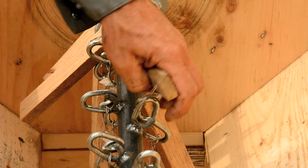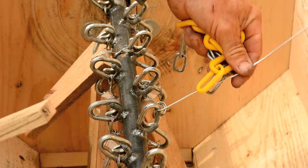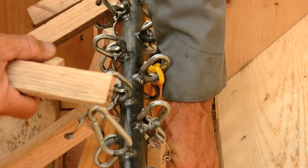This is the basic setup of the thresher. It just has flails on these little open links. We have experimented with a couple different kinds of flails. The bike spoke works very well for beans because it doesn't break the bean seeds. We have also experimented, when something like beans are a little greener, with a bit of plastic chain. Metal chain would be for hard seeded crops that need to be hit very hard.